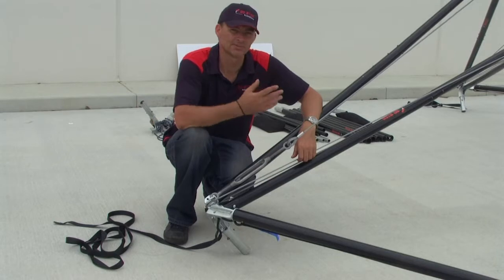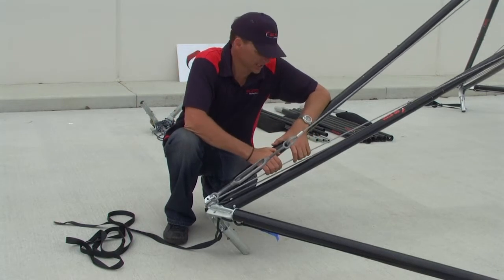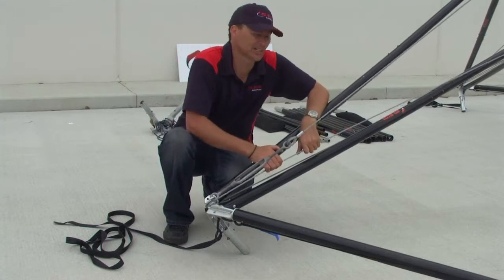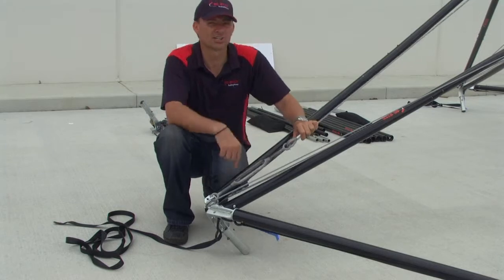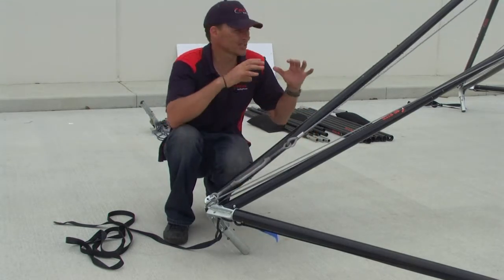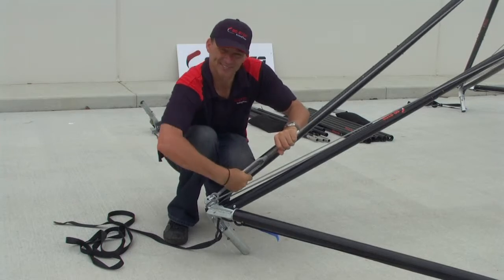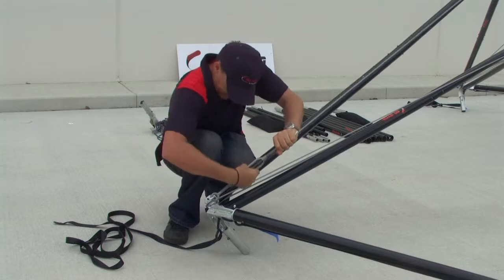Once the load has been taken off the centre dropper, it is important to go back and check the wires. The radial wires, these are the ones running from the corner to the central dropper, should still be fairly firm. If they're not, tighten them up with your hands. The triangle wires that run around the outside will normally be a bit loose. This is because the tension has been taken up by the unit. Retighten these wires as tight as possible by hand.